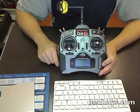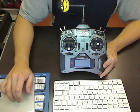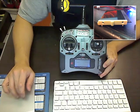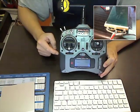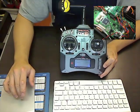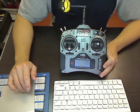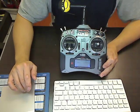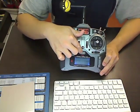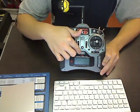I'm not going to go into a lot of detail on how to do this mod. If you go to the website, you can see some diagrams and pictures on what I did. It basically involves drilling a couple of holes on either side of the LCD mounting bracket inside the DX6i, then hot gluing the LEDs to it. Then you have to get power from the transmitter PCB board. I soldered the positive and negative onto the contact points named 'on' and 'back'. Whenever you turn off the on/off switch, so does the LED — it comes on with the switch.